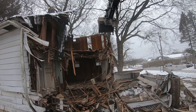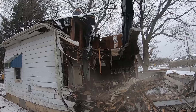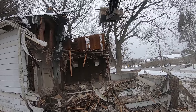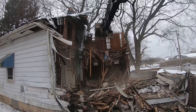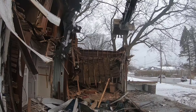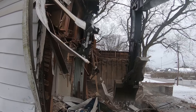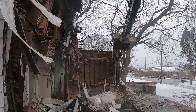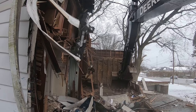Here's the remaining front corner — we'll pull it into the house. Here's the final front corner. We really don't want this to go away from us; we want to make sure we pull in. When we take the corner away, we're going to take away a lot of structural integrity from that other side. So we kind of want to nibble away at it — nice and careful.